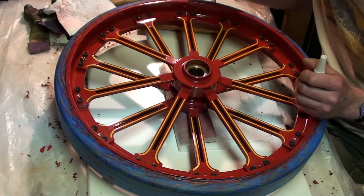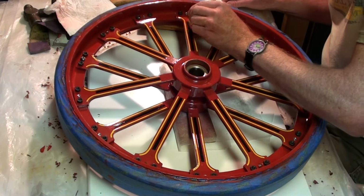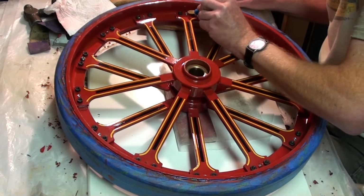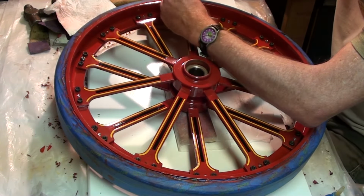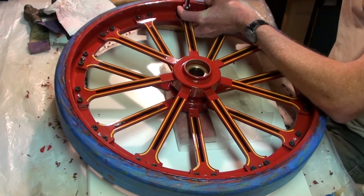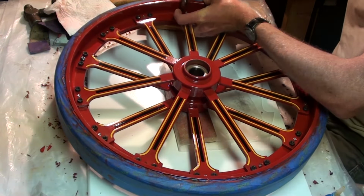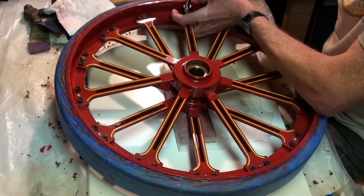Before painting the rivet bolts and nuts, more JB Weld was mixed and a small amount applied to the top of each nut. Once dry, each nut was carefully ground using a rotary tool on a flexible shaft. The intent is to round over the nut head and blend it into the end of the bolt. When completed and painted, the nut will resemble the head of a rivet.